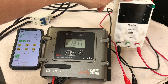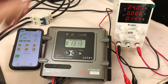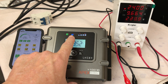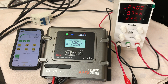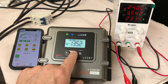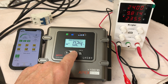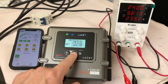I'm going to turn on the benchtop power supply — I've got it set to put out 10 amps and about 24 volts. Now we're showing 13.5 volts and it's in bulk mode: illuminated battery icon, illuminated solar icon, and we're flashing up top. I think I've got about three quarters of a battery charge in there. Cycling through the battery side, we've got 13.53 volts, roughly 16 amps going into the battery. We've put in 0.23 amp hours and that's going up because we're currently charging. There's a charging icon and then back to voltage.